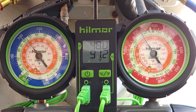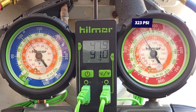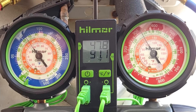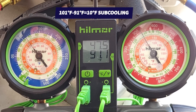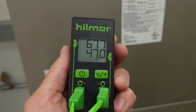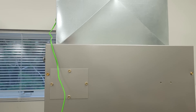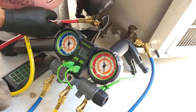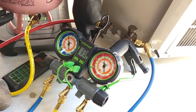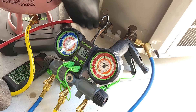It's been about two minutes and we're reading a pressure of about 323. We bring that into the R410A saturated temperature inner ring and we have about 101 degrees. 101 minus 91 and we're left with about 10 degrees of subcooling. That's all good. We have roughly a 19-degree delta T — that's the temperature change across the indoor coil from the supply plenum to the return plenum. Now I'm going to shut this right here and move this temperature sensor and quickly disconnect.